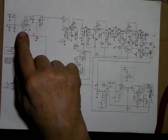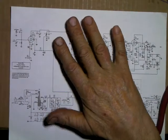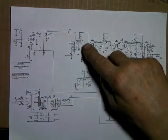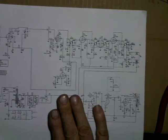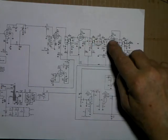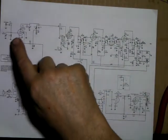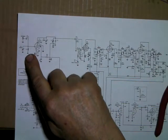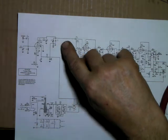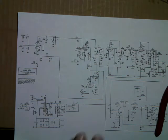It has a RF amp, a 6AU6 RF amp. And the mixer local oscillator is a 6BE6. And then it has 2 stages of IF with the 455 kc IF cans on both sides. So when we come back, we're going to find and make the coil for the antenna input coil. And we'll probably also have time to make the coil for the plate circuit of the RF amp. Those are where we're headed next.